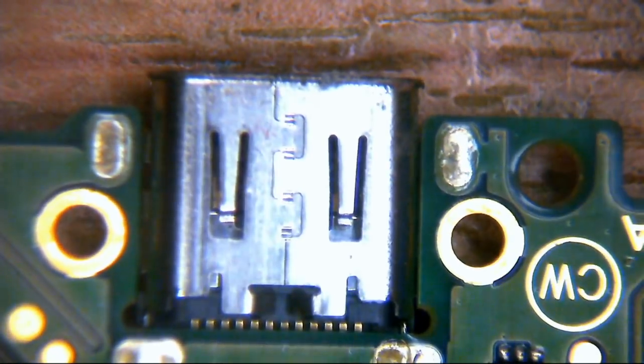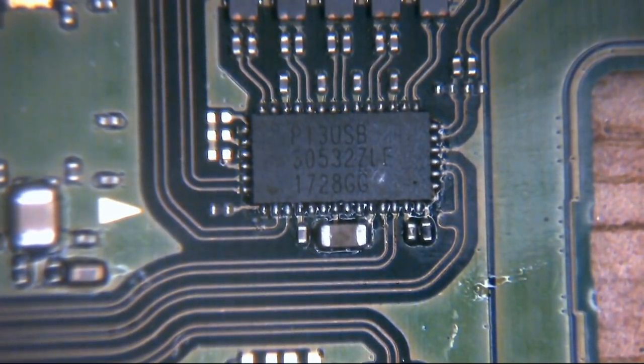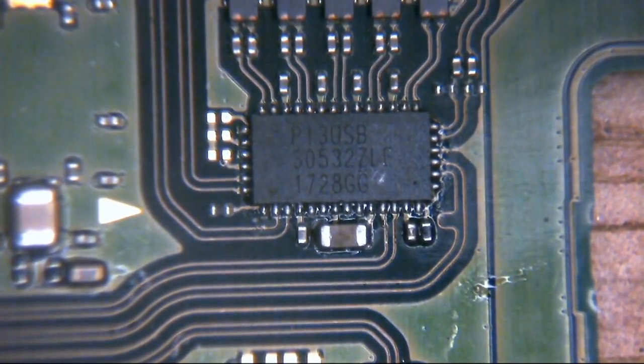So, yes, when that chip goes bad and it shorts, guess what? It can also take power out to your console. And, of course, because it's very similar in layout and design to that PS4 circuit, and we know just how troublesome those HDMI encoder ICs can be, this thing here is just as susceptible to failing, and when it does, it has the potential to take out power to your console, which is really shit, because at least on the PS4, that doesn't really happen.